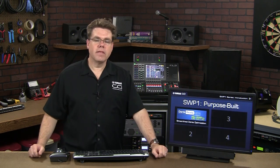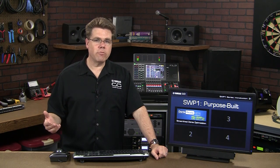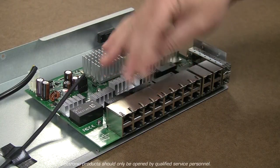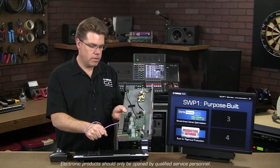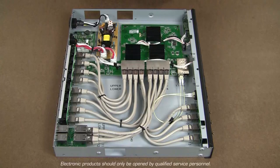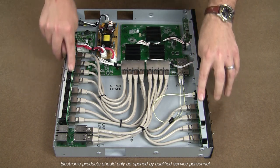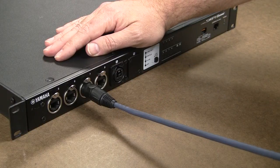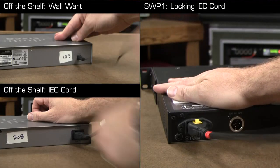Because the SWP-1 automated a lot of the IT drudgery, we're sure it's set up properly. So the SWP-1 is easier to set up — but is it a better network switch? Let's look at the build quality. On most off-the-shelf network switches, you'll find blocks of connectors supported by the main circuit board. If someone snags a cable, they're straining the main circuit board. The SWP-1 isolates the main board: the Neutrik etherCON and opticalCON connectors are mounted directly to the steel chassis.